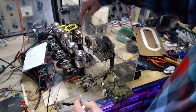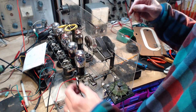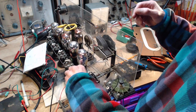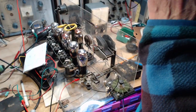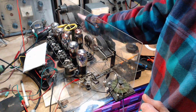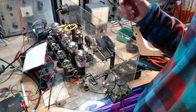Oh, you know what? I disconnected the local oscillator when I did that. So we need this local oscillator hooked up. I'm not going to get anything. The impedance of the antenna is very low. So okay, local oscillator is still operating. No tuning effect whatsoever. The local oscillator is moving fine. So this arrangement didn't work worth a hoot.